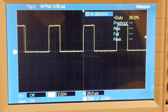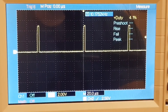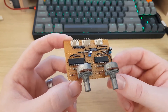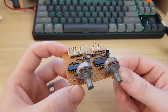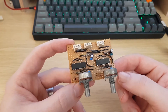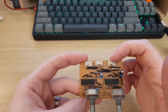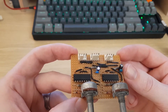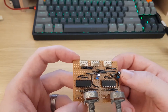I can see the frequency going down as I turn down the pot. This is an example of one of the 556-based circuits that I put together. You can see it has two channels — they're both the same. The headers on the left and right side are outputs to four-wire fans, and this header is for the supply voltage from the power supply.